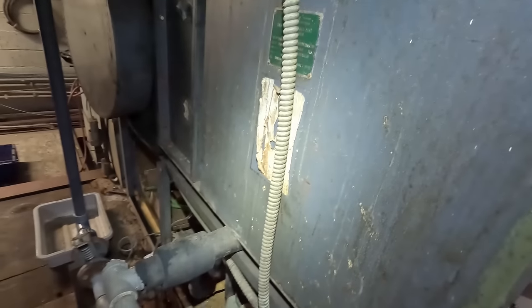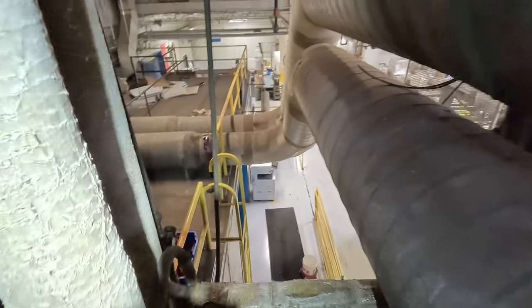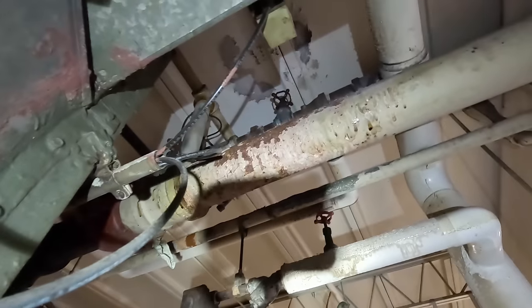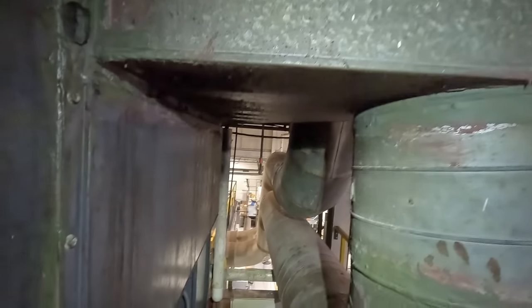The air conditioning coil looks like it's right there — it kind of goes up in here. That's some thick metal too. Here's some of the dampers open and close. We've got two different ducts going out — I'm pretty sure one's hot and one's cold. The return is coming into the back side. You've got your steam boiler lines right there. I don't know how big that coil is so I can't really just drill in there — maybe I can drill a hole into the duct just to see if we've got something big going on.